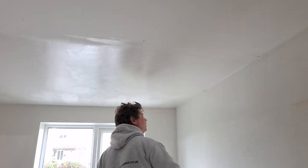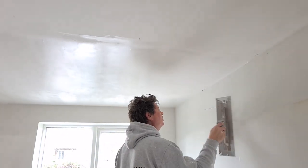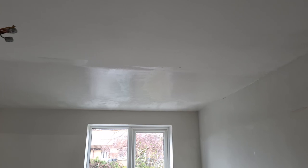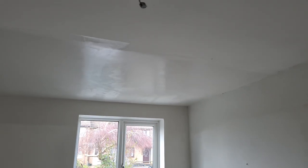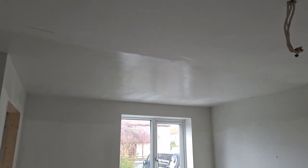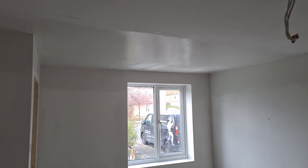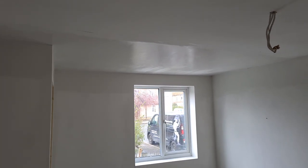And he's not trying to do it super quick. It's not about being the fastest plasterers in the world always, because a few minutes longer when trailing off saves you a lot of time when you're sanding, and the process is quick enough anyway to not be trying to go a million miles an hour.